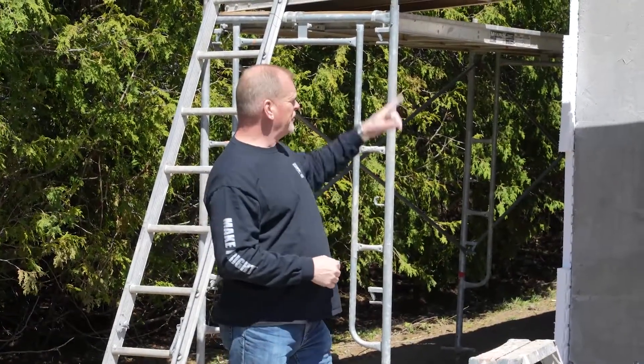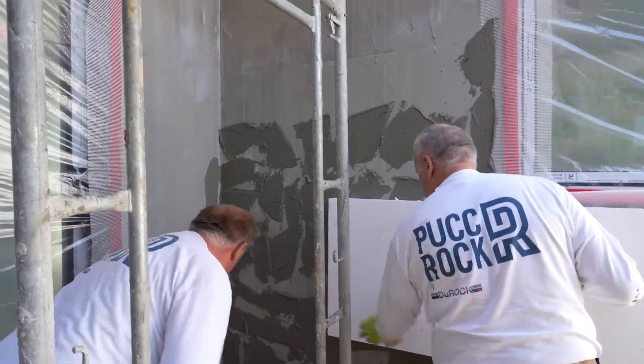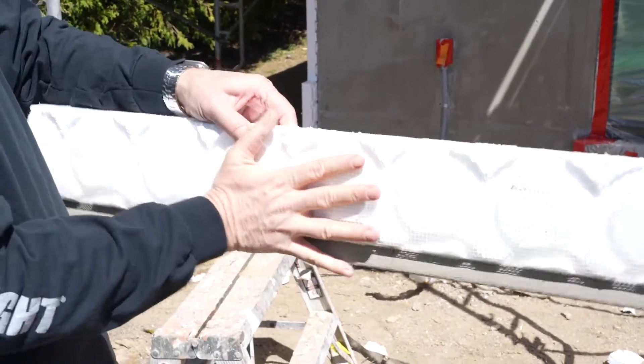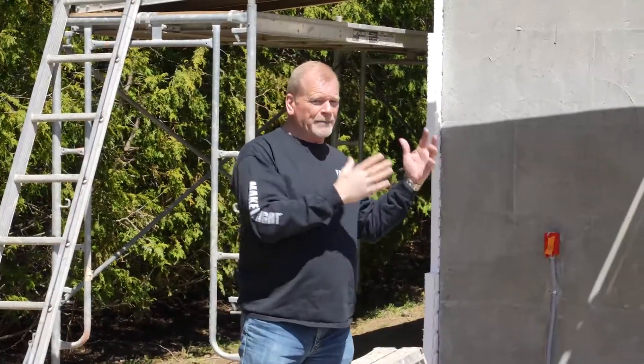Dasano and his crew are here doing the prep coats on top of the ICF, then a base coat on top for the new foam going in place. It has a puck system on the back — this is the bottom starter strip, finished all the way around. The puck feature bonds to the wall directly to the foam, but over top of the protected layer. This is just brilliant. Adding two more inches of thermal break on the outside of the existing two and a half inches gives such a high R-value that when cold winter tries to come in, it won't — and when I want to keep it cool in summer, it will stay inside.